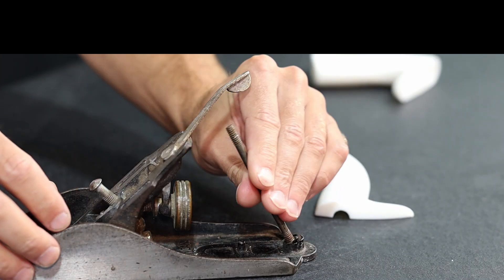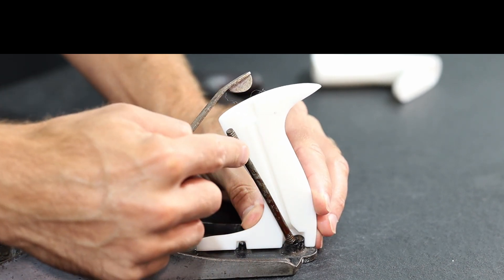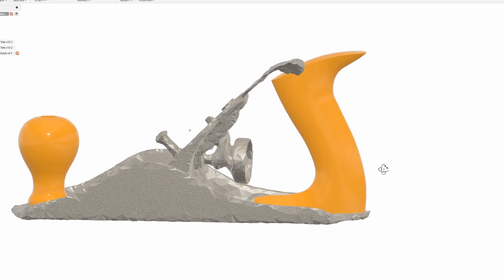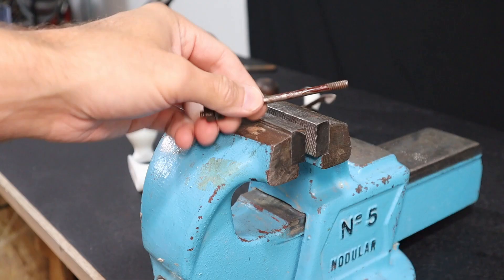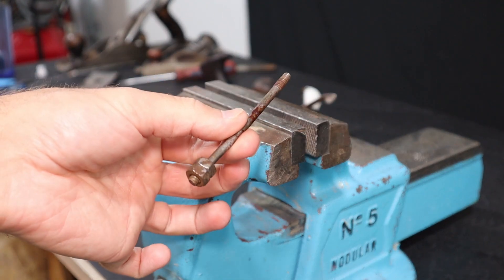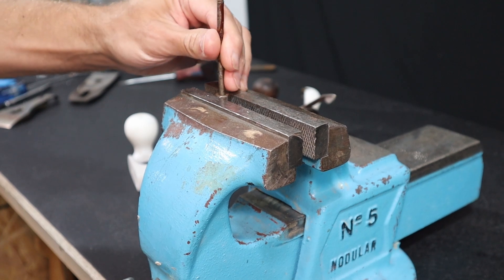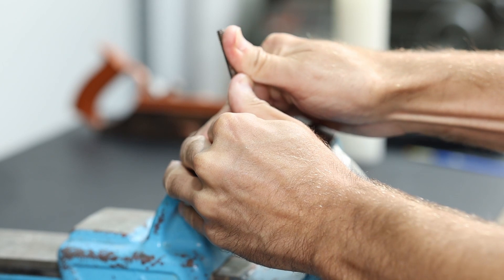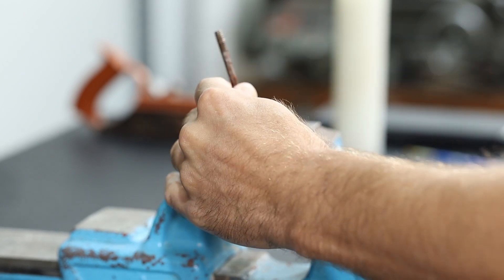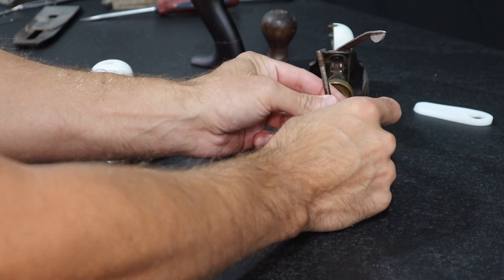With the cutaway version I can also see how much the threaded rod is affected. As far as how well my hand fits, a few things need to be adjusted — it is a small plane but the tote can still be a little bit larger in depth. Because I've changed the angle of the tote, the threaded rod needs to be adjusted to match, so I've added nuts to one end of the rod to protect it, mounted it in the vise, and a quick adjustment by hand is all that's needed. The rod will thread in a little bit wonky but I think that's going to work just fine.